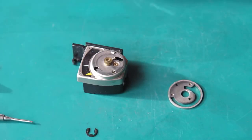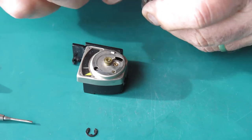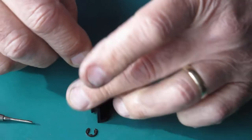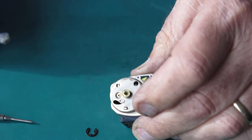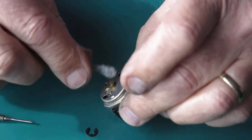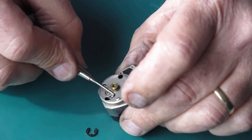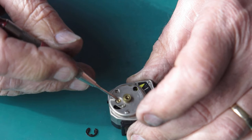This is what I'm dealing with here — this old grease is a bit sticky, dried and sticky, I just want that off. You can see where over time that grease has collected dust and it acts like a grinding compound. When grease picks up dust it's actually cut through the nickel plating at that point.